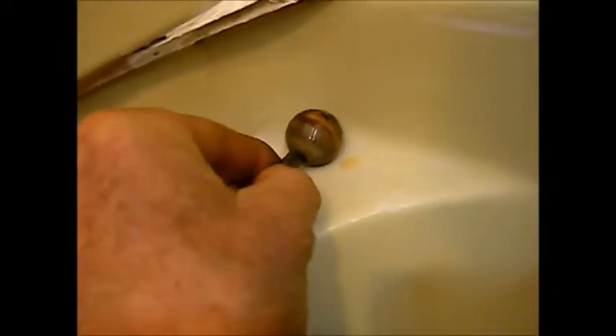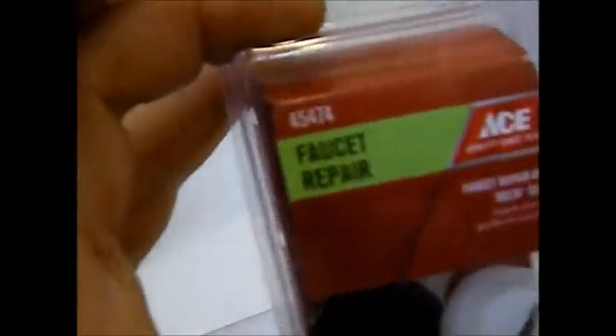Got it off. There's a little ball in there - it's important to keep it the same way it came out, so that's the upside. I got the two washers on the right and left - gotta pull those out, there's gonna be springs behind them. I'm gonna swap those with this Delta style faucet repair kit. You can see the old one's got a little wear ridge on it.